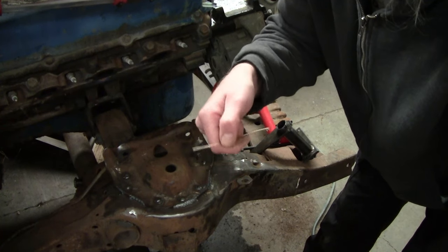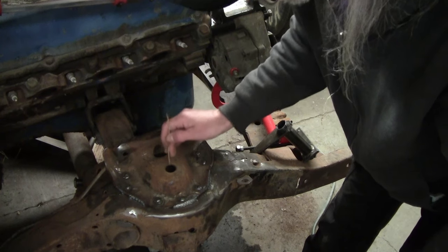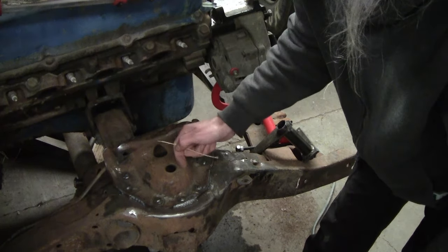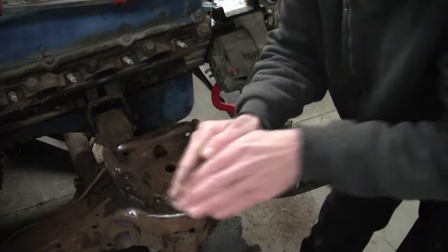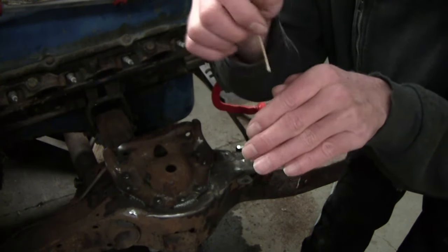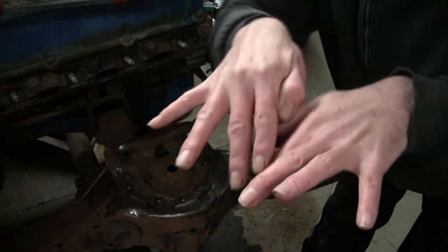By hard hit, I mean you've got to hold the trigger down and make your wire more straight up and down. As you roll it in, roll it up, and as you roll it up, you let go. A hard hit in the center will do the same thing. All your fill from those tacks will kind of build up like a volcano, and then right in the center of it, you lay into it, and that'll lay it all back down.